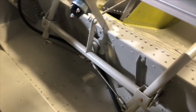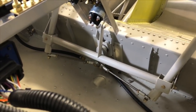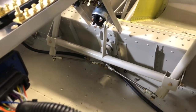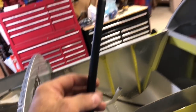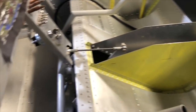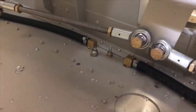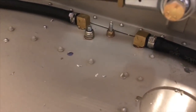Let's talk a little bit more about the fuel system, since that could be an obstacle with low-wing aircraft. What we've done here is very simply — there's just a hose hanging here that is going to come from the wing. You can put a low-pressure filter in it if you want, but it enters the Zenith low-wing aircraft right down in this corner, in front of this bar. And then from there — and it's the simplest thing ever — you basically have your header tank, as we showed, mounted underneath.